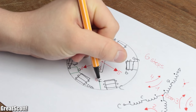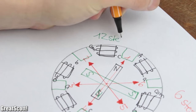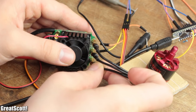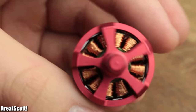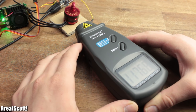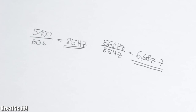The reason is the double number of coils and especially the permanent magnets, which cause a lower RPM but on the other hand a bigger torque. That is also the reason why outrunner brushless motors are preferred when high torsional moments are necessary. Due to more space on the outside, they can simply accommodate a higher amount of magnets, and thus achieve a lower RPM and a higher torque at the same frequency.